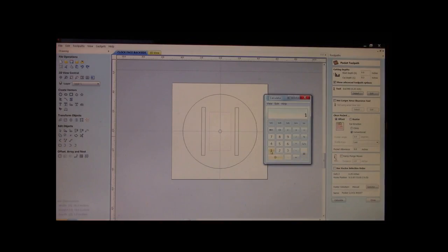We know that our material is 1 inch thick, 1.000. We know that we have the capability with that insert of going through a maximum face thickness of 9/16. Once again, 9/16 works out to 0.562. So we're going to subtract 0.562. Okay? That's going to equal 438 thousandths is what is left over.